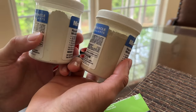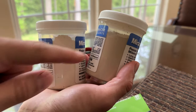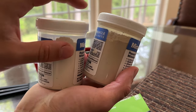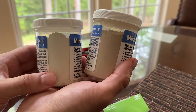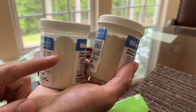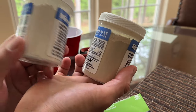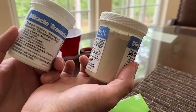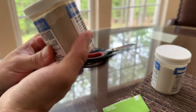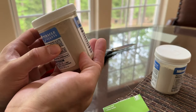If you take a look at these two powders, you'll see that they come in a lighter consistency and a darker consistency. You can mix and match these as you mix them in your water cup for the exact color that you need. I eventually got lazy and started using exclusively white because it's difficult to spot, even if you're using purely white. So this is another reason why I like this stuff by Rust-Oleum — this Miracle Travertine Fill Kit. For the purposes of this demo, I'm going to switch it up and exclusively try the lighter powder, which you can mix and match to get exactly the color that you need.